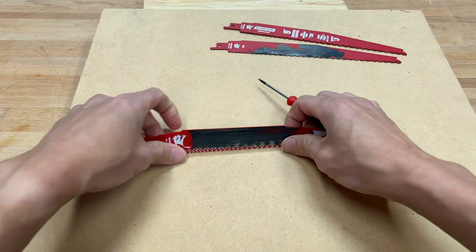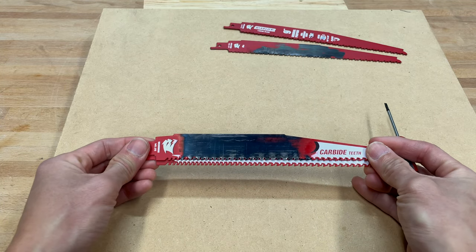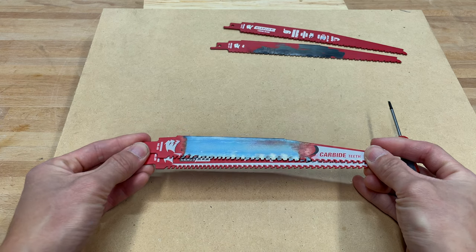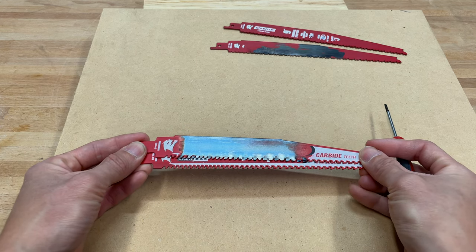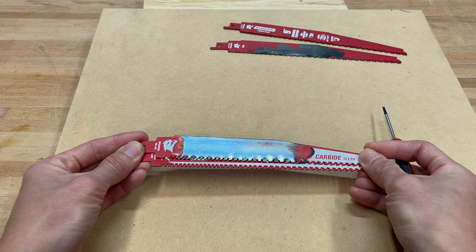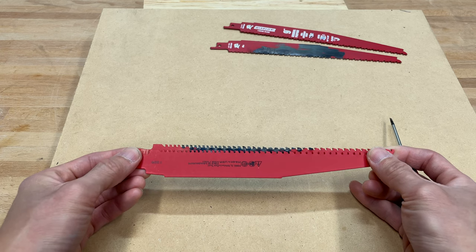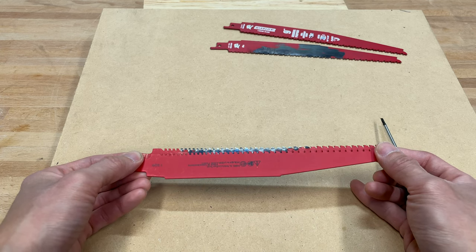If you want to look at the underlay or overlay of the two blades right here, as what it's supposed to look like, you'll see the teeth that are supposed to be really sharp, the carbide tips have worn off. It will probably still cut, and it will continue to probably still cut. It just won't do as well. It'll probably just continue to rip, right?